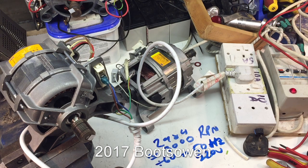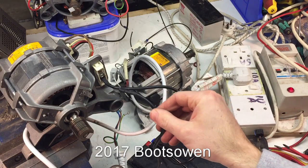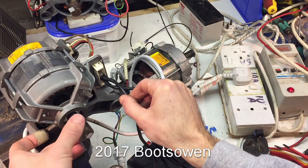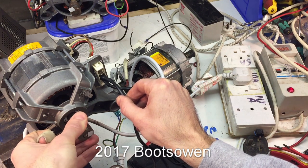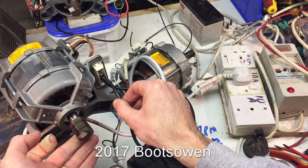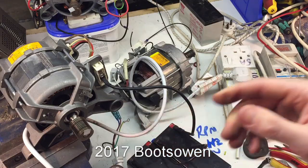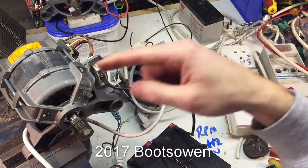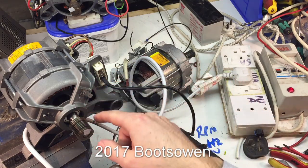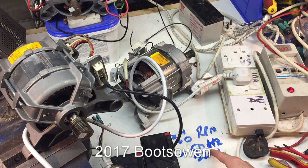Let's give it a different frequency now. I've got two 12-volt lead-acid batteries wired in series giving me 24 volts DC. If I touch this off one of the three phase points, nothing happens — but what is bizarre is that when I try to rotate this rotor, it's stiff and feels heavy. I let it off and it spins quite freely, but once I put the DC power on it just gets stuck. I can overcome it but it locks up. If I added another battery it would become more and more difficult to turn. That's because we're putting power through one of the windings but it's not oscillating — it has a frequency of zero. So the motor isn't inclined to turn but the power is there, and it just locks up the motor. It illustrates that point about the 50 Hertz relationship I was explaining earlier.